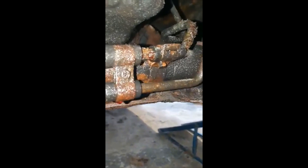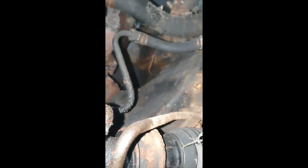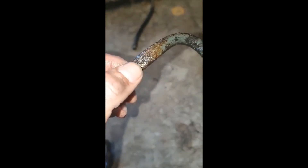Underneath here, it's coming from this top pipe — it's just white from where it's corroded away. So I'm going to take that pipe off from the fitting there, disconnect it from that hose there and that's it. Well, it's off — only took a bit of persuasion and a tiny bit of mess. You can see in this corner what state the hose is in — there's just a crack in there, so it's just been waiting. And that's it, simple as that. Let's go and get one made.